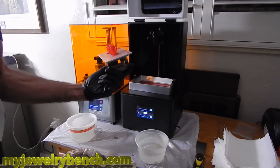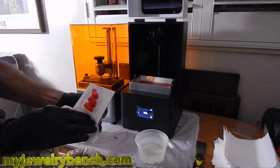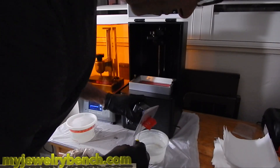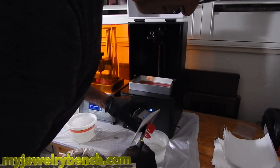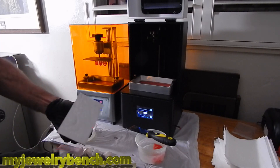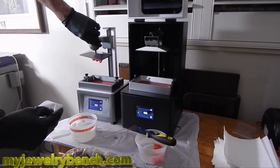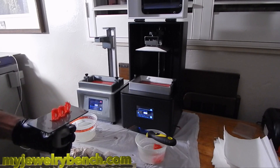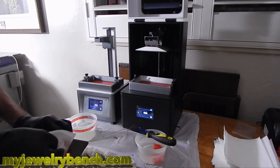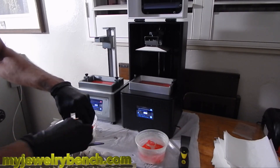The prints are done — this is a few hours later, and it's dark outside. We're going to pull these prints off the build plates. This is very flexible resin because it has a lot of wax content, so the prints are going to be a little on the flexible side — be cautious with it. You can see they bend pretty easily. They do come off the build plate really well if you follow those settings. Now pulling the prints off the Elegoo Mars, I like to wipe everything down before I pull the prints off, just so I don't drip any resin anywhere.